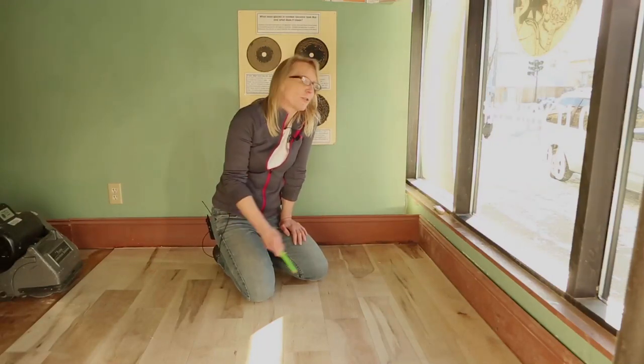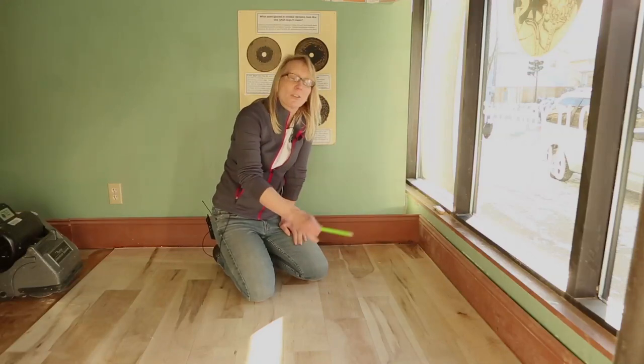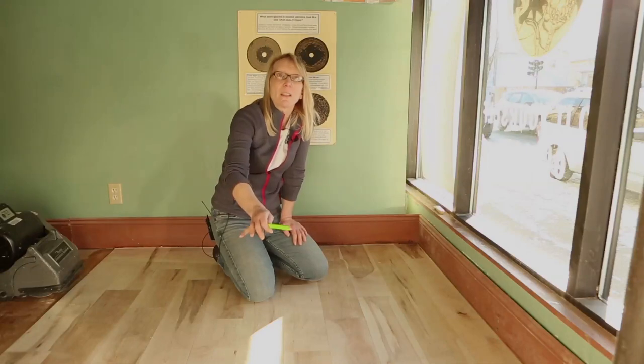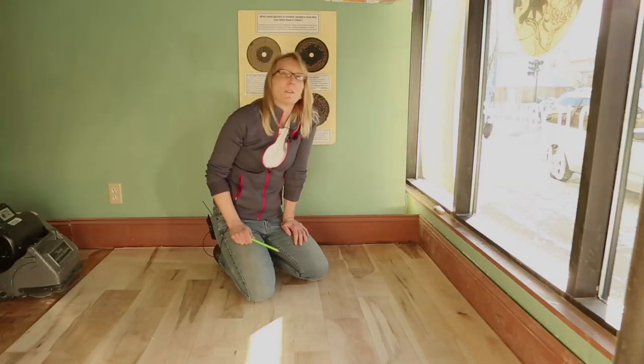Your edger should be able to rip through a pencil line with nothing — just looking at it. So it gives you two things: it tells you where you've been so you don't skip anything, and it makes sure your paper is always sharp, which means it's cutting out the swirl that came before it.